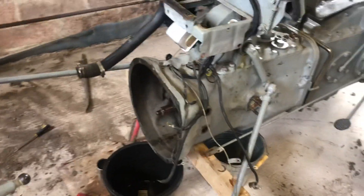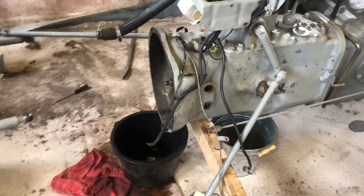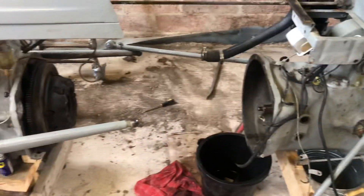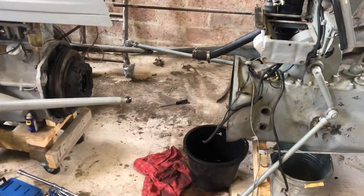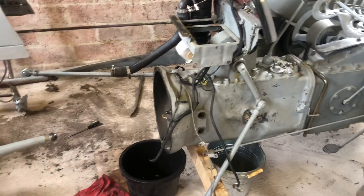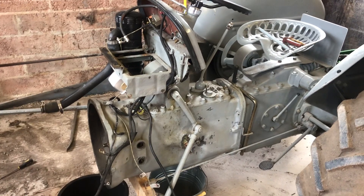The next stage is to put the seal back in, give all the parts a good clean up, paint any areas that need tidying, and give everything a good degrease. Then it'll be reassembly, and I'll show it all reassembled back inside the bell housing. After that, the next step will be to begin putting the front half of the tractor onto the back half — that'll be a bit tricky as you'll need to line up the input shaft into the flywheel and clutch. So far it's been quite an enjoyable project; I'll keep you updated in the next video.